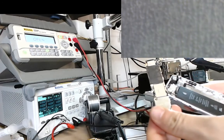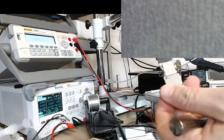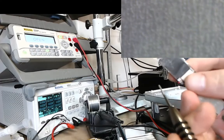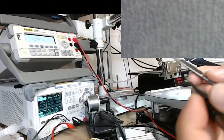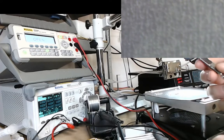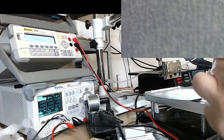I think that this repair has been done in situ. They've not taken this board out to do this repair, because that there looks like flux all dried up on the bottom of there. That's all cracked. Let me just remove that for now and see if anything else has been done under here.